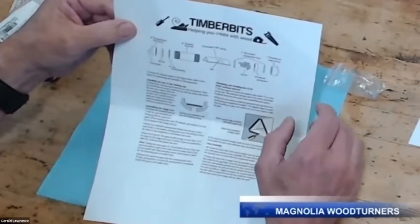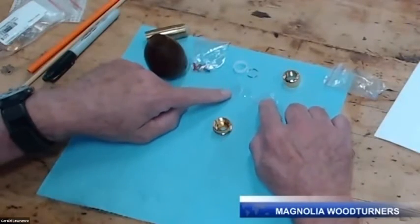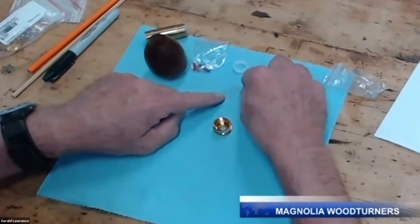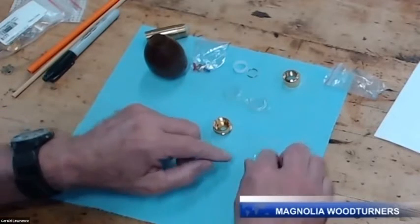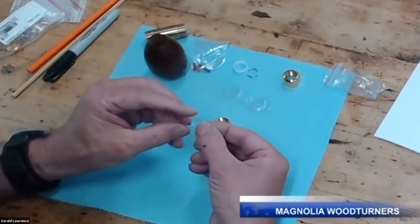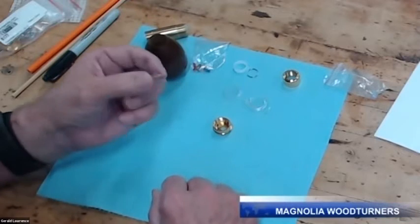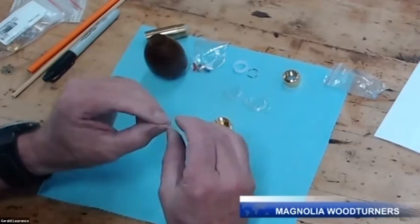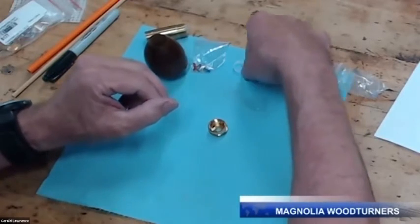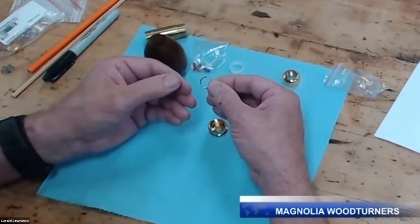of the assembly. So the first thing you do is these little lenses here, there are three lenses, it's a little bit hard to see on here. Two of them are in plastic, protected. And then the third one is convex on one side. I know you can't see that, but it is convex on one side and flat on the other. So it's a little bit of a magnification that you look through. So you take the convex side, lay it down in here, and then you have this little C-clamp or snap ring that goes in there.